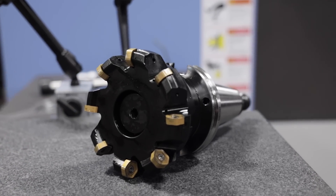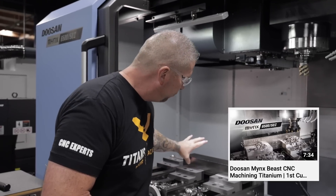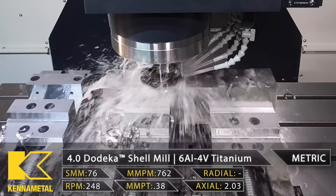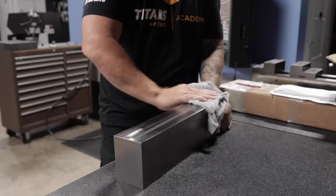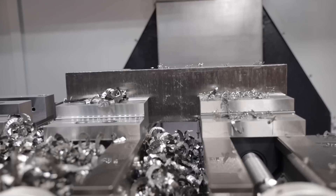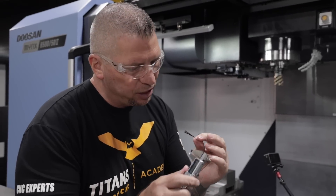Very important — if you didn't see the video, we just posted a video with the Dodeca making these cuts right here. It's important because as machinists, you've got to take that information in, look at the tool, document it, look at the surface foot and the chip load we gave you, and listen to the tool. I wanted a semi-nice surface finish that I could actually grab onto for this big cut today. I was at 30 inches a minute — about half the feed rate I would usually use on that Dodeca — but even going half speed it cut a beautiful chip. This chip right here is about 13 and a half thousandths, so at 30 inches a minute; if I went twice as fast it would be twice as big.